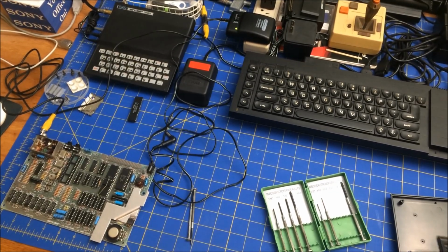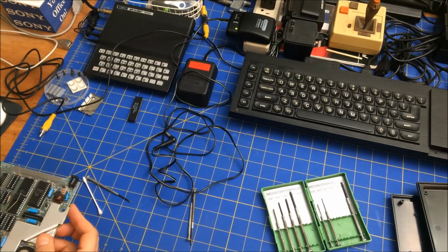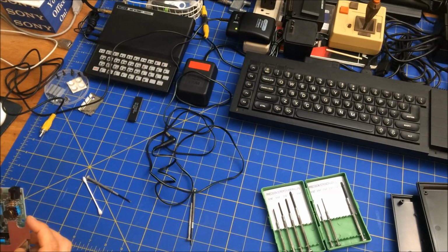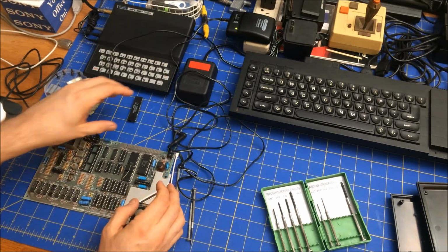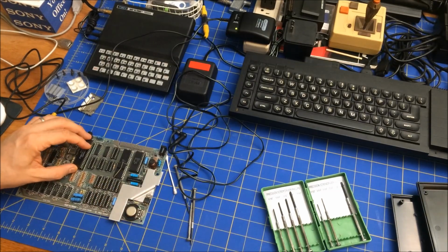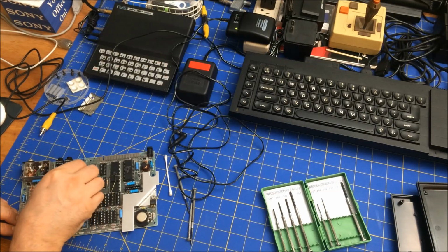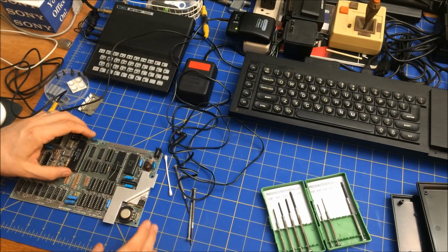And I don't know what's causing it. So I need to kind of put it back together. It's a wee bit crusty, but in any case, I took the Ferranti chip out, and I got to put that back in here. So that goes actually, yep, there's the notch, there's the notch. So this goes back in here like that. Make sure you line up all of the various pins. There we go. Now it just needs to be pressed down.